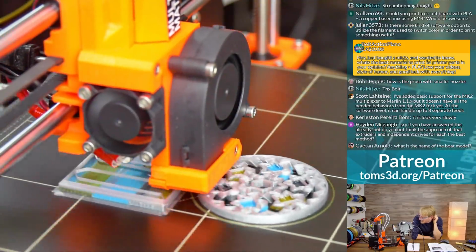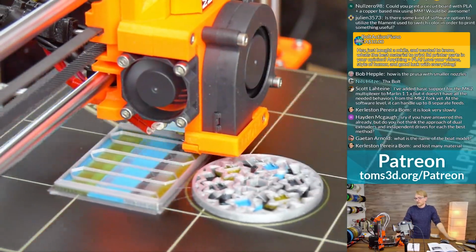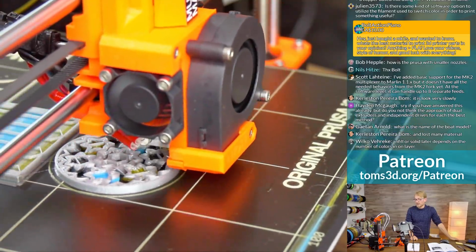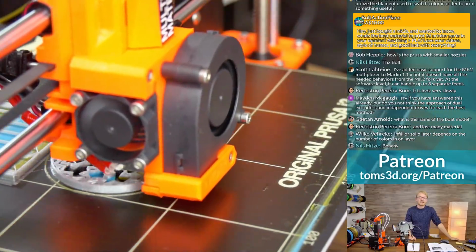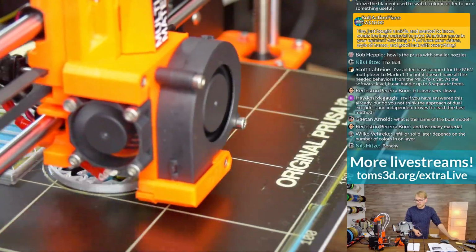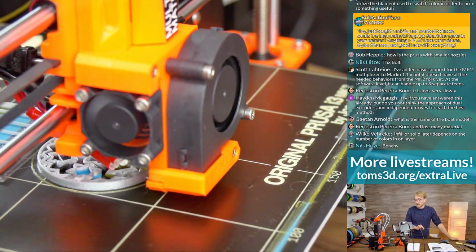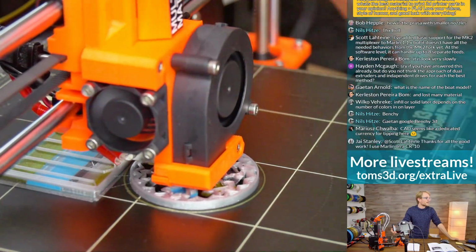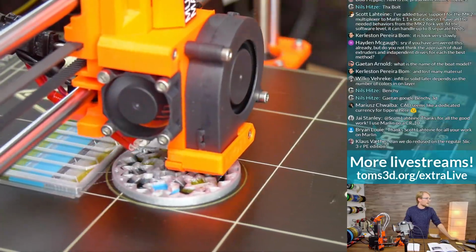Well, there are materials that are worse than PLA as far as suitability for 3D printer parts go. But PETG is perfectly fine for most printer parts, unless it's really close to your hot end. In that case, I would go for an ABS or an ASA or polycarbonate or something like that. I would not use PLA for brackets, for anything that is mechanically strained, that has a bolt through it or that holds a motor or anything like that,